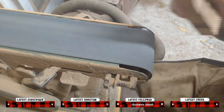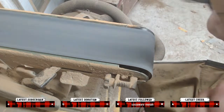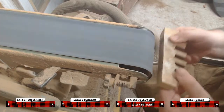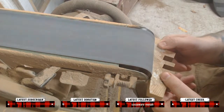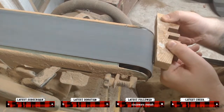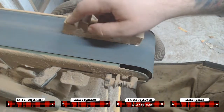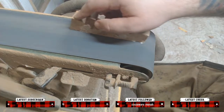This is also testing my glue joints, and I'm happy to say they're all quite strong. Like, I can tell this is super rough. Or wavy, not rough. Like it's doing this. That's because of how the bandsaw blade works. Ideally a bandsaw blade is just stretched over between two pulleys. My bandsaw is old and secondhand and not set up super well. So parts of it are broken and parts of it are just not tuned 100%. And as a result, you get wavier lines.